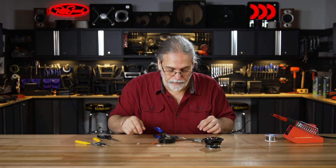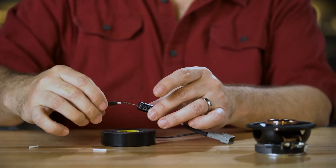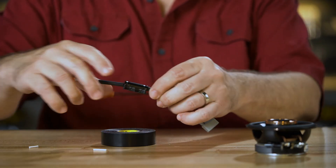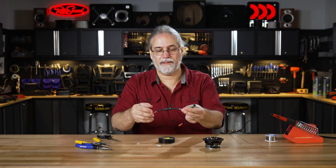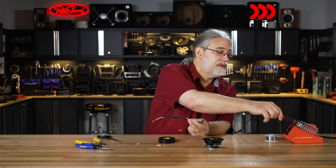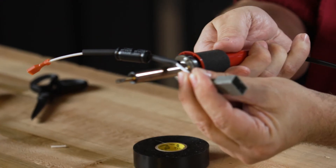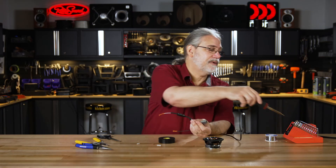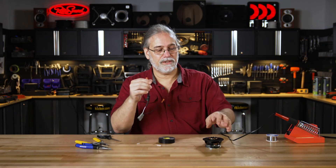Going to cool that off a little bit and remove our heat sink. Slide the heat shrink tubing up over the wire to cover the wire and the capacitor's tensile lead, and we'll end up with something looking a little bit like this. You can use almost any source of heat to shrink the tubing down — in this case I'm using the barrel of the soldering iron. Once that's shrunk down a bit, turn off our soldering iron, and we're ready to attach it to the speaker.